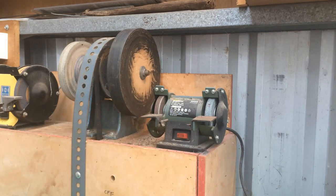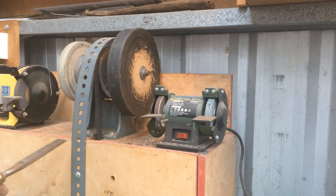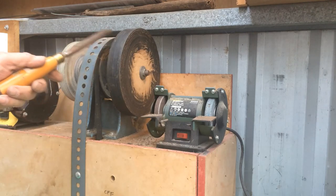These two here are just simple little grinders, nothing to do with this knife sharpening thing. I suppose you could pre-sharpen your things on that. But all it is is a washing machine motor in here, a switch, with a belt driving a mandrel with two wheels on it.